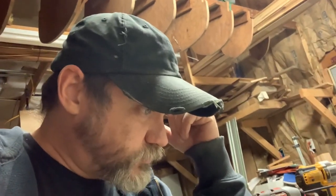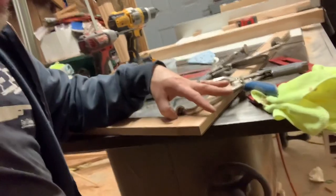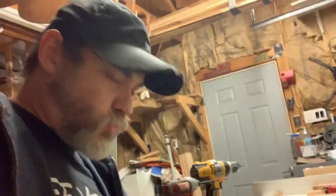These are the Kreg pocket hole clamps and they're so weird. There's this adjustment here — see that little thumb screw? If you tighten it too far you're not going to get it clamped. If it's too loose it's not going to hold strong enough, and it's a very fine line. When I get it set and squeeze it down, it's good for one joint, but once I release it and try to use it on the other side it was giving me issues — either too tight or too loose. It was frustrating.